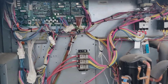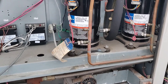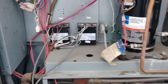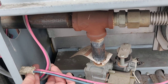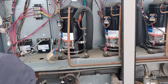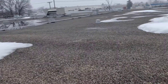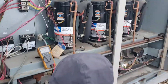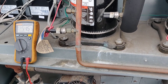On this unit I had a code 66, which means the pressure switch is open. The inducer was working when I first came to it, but when I turned it off and restarted, the inducer didn't work. I want to make sure we're getting the right voltage to the inducer before we determine that's the problem. Get the meter in there — turning it on — it's reading 253 volts. That is the right voltage, so yeah, this inducer is bad. We need to replace it.